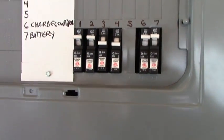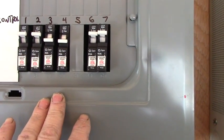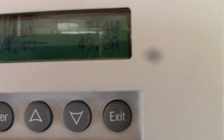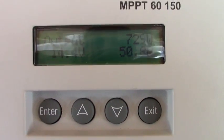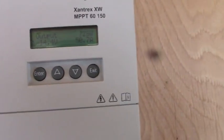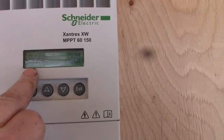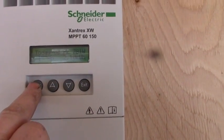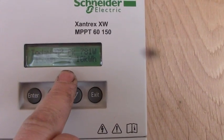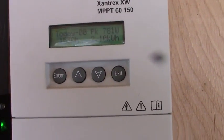In here I've placed two more circuit breakers which are not in use right now, but they'll be for our additional panels as things go along. The new charge controller — I don't know if you can read that — but it's saying the output is 730 watts at 50.7 amps. That's what it's charging at because the value in the battery bank right now is 14.4 volts, still charging very well. So far today we've got 153 amp hours at 2.10 kilowatt hours.